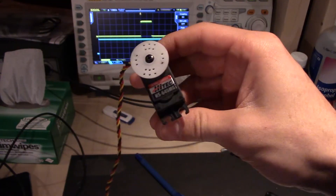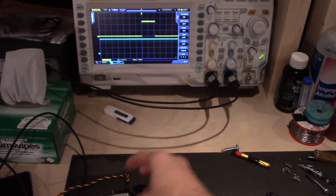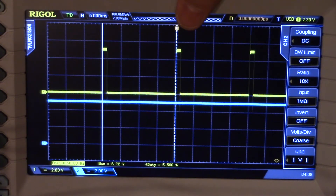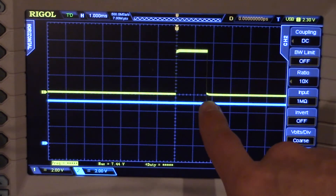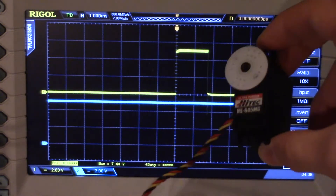So I have my Arduino snaking from my computer all the way to my test equipment setup. In a moment I'm going to hook it up to this servo, but I want to show you guys what the waveform looks like on the oscilloscope. On the Arduino I have a sketch that is just sweeping through 900 microseconds to 2100 microseconds — that is your servo motor pulse. And you have a period of 20 milliseconds, that is your 50 hertz. If you zoom in, I can show you a single pulse and you can see it is sweeping. Now let's actually hook this little bad boy up.